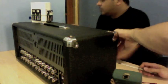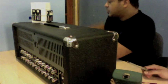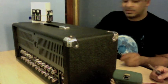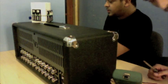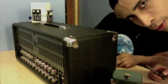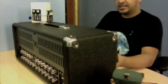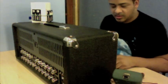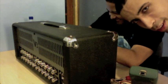Since we need some narration anyway: unlike my Traynor YVC80Q, which has auto biasing on the power tubes, which basically means the PCB board of the amp auto biases the tubes. That also means, Carvin, you should have put a little bit more effort into this amp if people were paying this much money for it. Also, my Fender 1990 Evil Twin has ports on the back for checking and adjusting the bias. Simplicity. Bitter, aren't you? I'm not bitter. I'm just like, seriously, guys, come on.